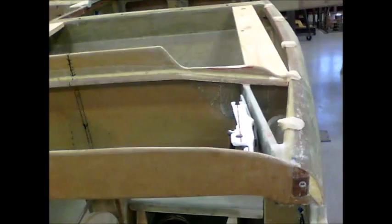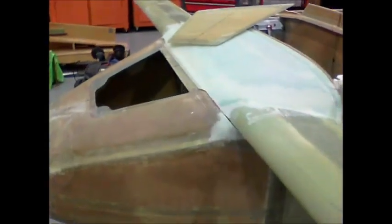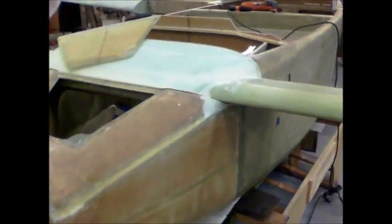I just wanted to do a final test fit on the canard after getting the fairing fiberglass on and everything bolted - it's nice and level and plumb. I've got these little flanges so the wing fairs right in here. Up under the wing I made some little fairings - there's a fairing that goes from here out about an inch and just tapers around, basically like a saddle for the wing. That's the left side, here's the right side.